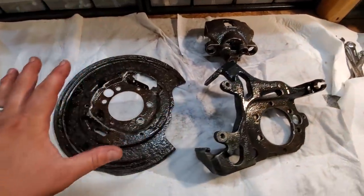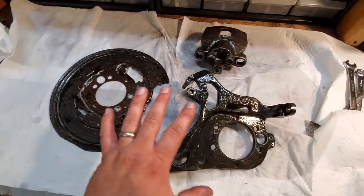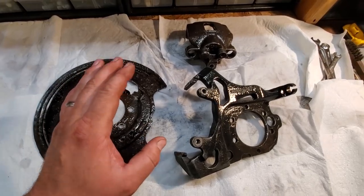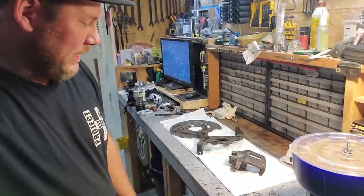If you're doing this outside in the sun it might haze up — you can see how it crystallizes and gets a little white. If it gets white before your 30 minutes are up, hit it again and keep it saturated. Once you've got your 30 minutes up, you're going to scrub it clean again and get all the etching material off. Scrub it down with water — make sure you use gloves — and let it dry bone dry overnight. The tumbling hardware continues overnight too.